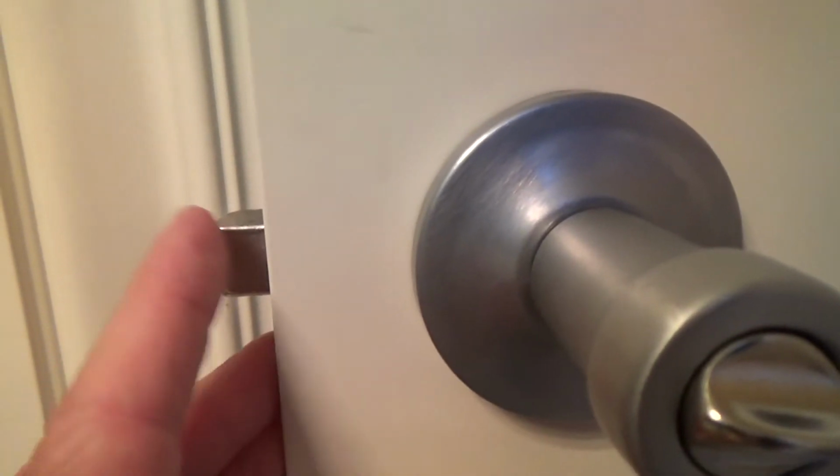And it's not because this door is sagging. If you watch my other videos, I did go up there and I sucked that hinge over, because before, this gap next to the side edge of the door was almost touching. Actually, maybe it had a 16th. Now it's got about 3/16 maybe. So I know this door is not sagging. The line coming all the way down here looks nice. Okay, and this door latch is still too low with the strike.